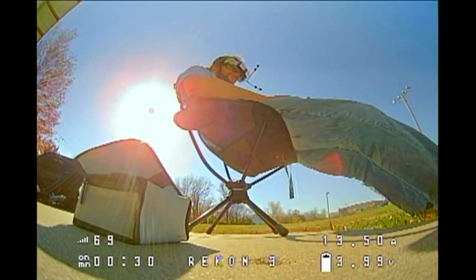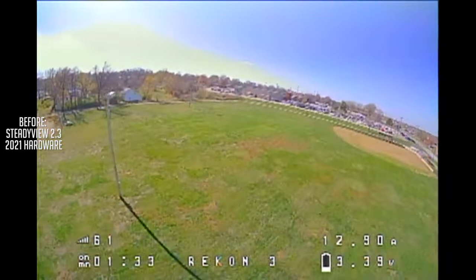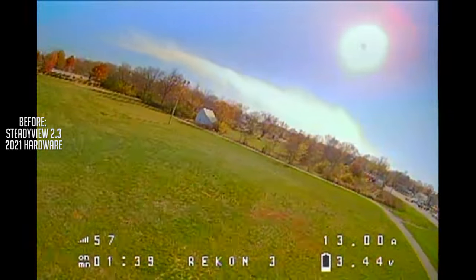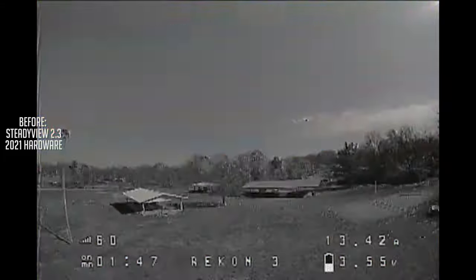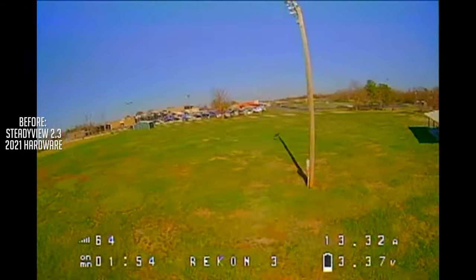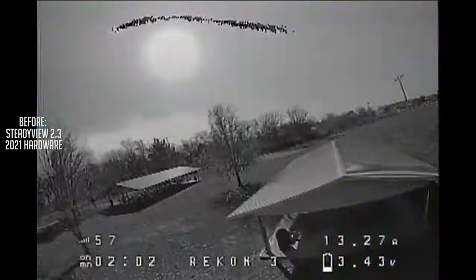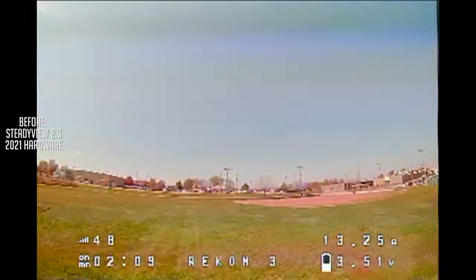So here I'm waiting to get my lock. It locks. I get the beep on the receiver and I take off for a flight. I want you to pay attention to the text — look where it says Reckon 3, the timer, the battery stuff. It's not moving, right? It's not shaking back and forth. The drone image is going a little in and out because the video transmitter on this thing is not the best. But you see that desync? Look at how all the OSD text is shaking. The entire image is now shifting from right to left, including the OSD text, because after that particular desync, the whole image has been thrown off. This is horrible. This is completely horrible. And this is an example of the kind of worst result you can get with the original SteadyView hardware.